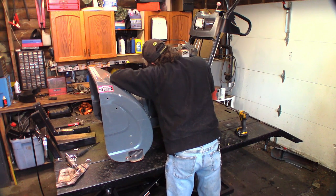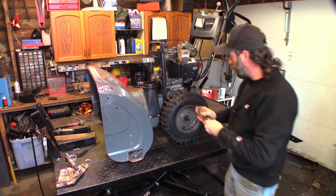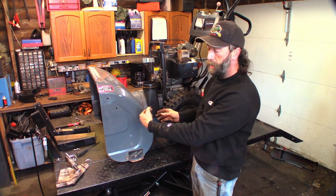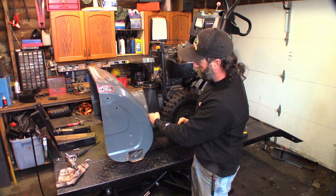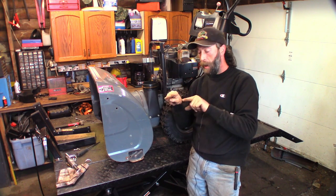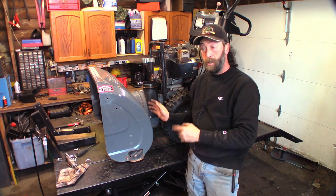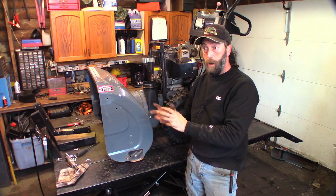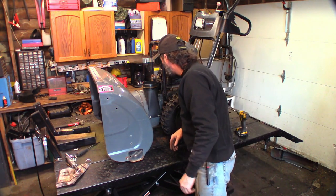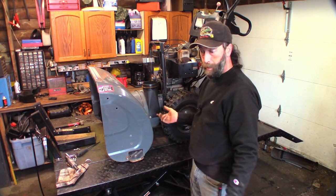Yeah, there it is. Wow - can't say I've seen that before. What it is: the back of the shaft goes through the impeller, through the housing, and into a bearing. That bearing is on a diamond-shaped plate with a bearing in the middle and two holes in the sides for bolts. The bolts go through from this side and there are nuts on the back to hold them. This one has no nuts and the bearing is actually not in its position - the bolts are just hanging there. We've got to pull the pulley off and get that bearing situated.